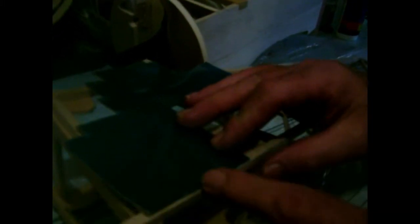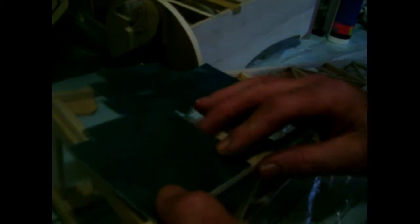Okay, then you find your straight edge. Bear in mind that you can follow the leading bottom edge of the longeron if you want, but don't forget, don't draw it so it's straight up, because that's the bit that catches people out. If you notice, that's on a slant, because when the plane's sitting normally, it won't be sitting flat, it will be sitting at an angle. So follow your pattern if you need. Right, so get that out of the way.